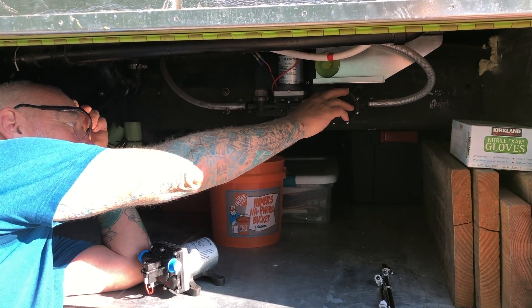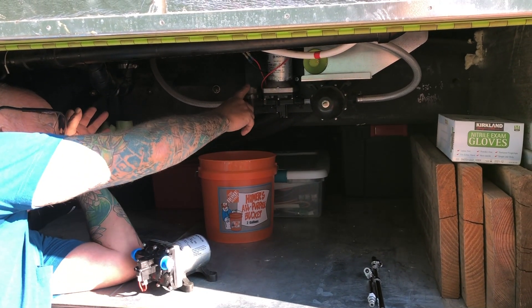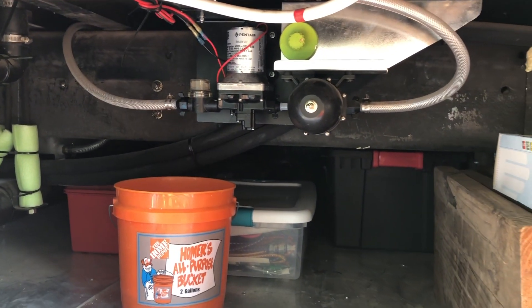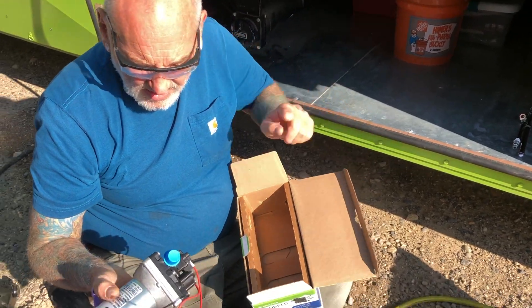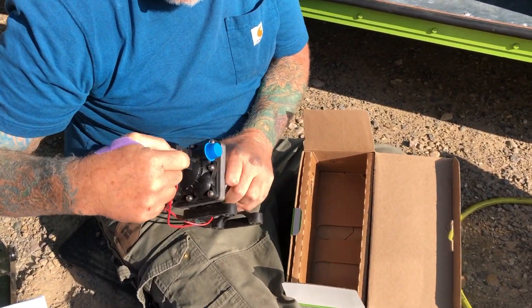It's all reinstalled. If you don't have an accumulator tank you should check that out — it really makes the system a lot smoother. I've got a pre-strainer, the pump, flexible hoses. It's pretty much a proper installation with all the info I've been able to acquire.